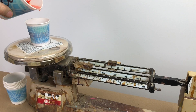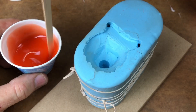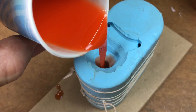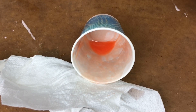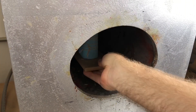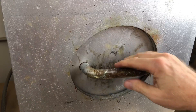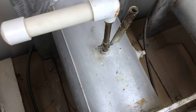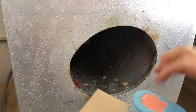I use this old gram scale — in the 35 years I've owned it, it's never needed a single battery. Always there, always reliable. Stir up the resin thoroughly but quickly; it's ready to come out of the mold in about half an hour, so you don't have too much time to get it poured. Resin changes color as it cures — it's darker when uncured and lightens as it cures. Pop it in the pressure tank, run it at about 80 pounds per square inch, and wait until it's ready.